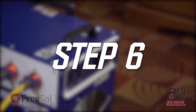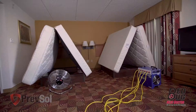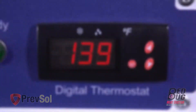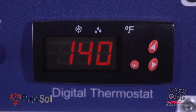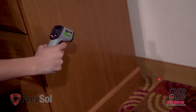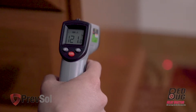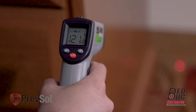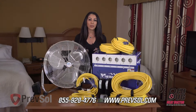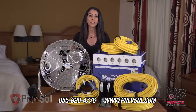In the last step, step six, you are now ready to turn the power switch and fan switch on. Run the equipment until the temperature reaches 135 to 140 degrees. At that point, use your thermal gun to check the cracks and crevices of the coldest spot in the room. Those temperatures we want at 121 degrees for three or four hours. For more information on the BK10, call the number on your screen or head over to PrefSol.com.